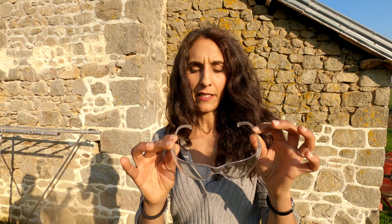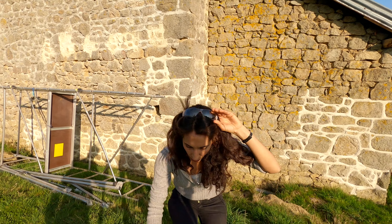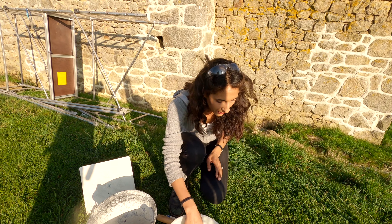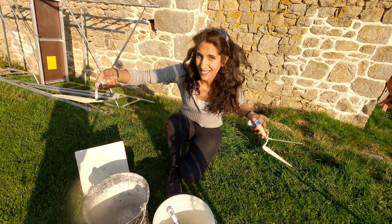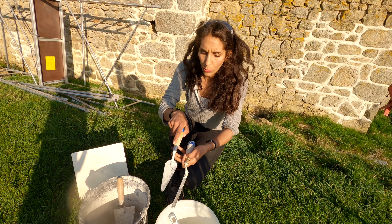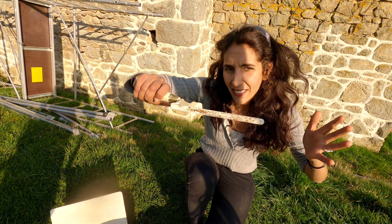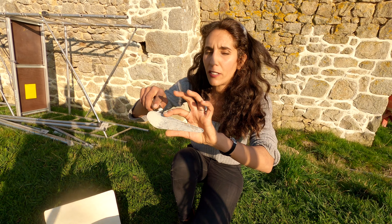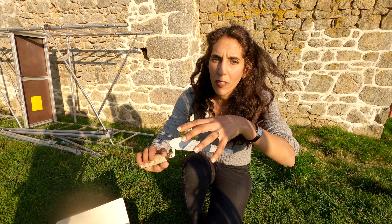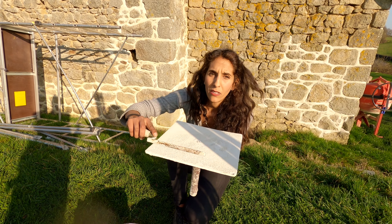The tools I'm going to need are safety glasses — definitely very important. We need to keep our eyes safe because if we get lime on our eyes, it can make us blind. We're going to need as well two buckets: one for the mix of lime and sand, and one for water. Then I'm going to use my trowels — three different sizes. This big one I use to pick up sand and put it in the buckets. These two smaller ones I use for pointing: the thin one to go between the stones and compact the lime mortar inside very packed and tight, and the wider one for when the space is a little bit wider, to put more quantity of lime and compact it in.